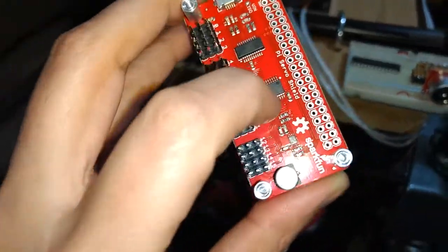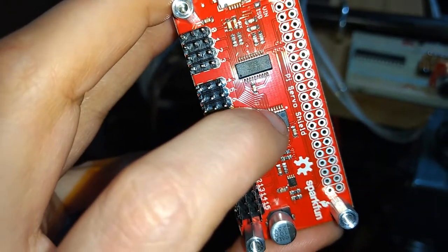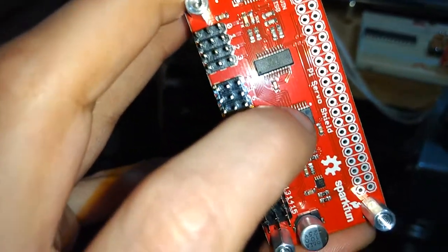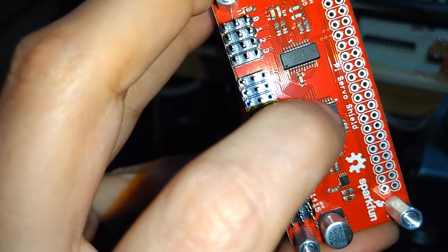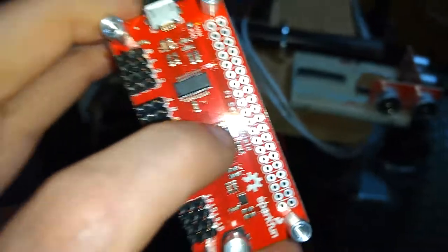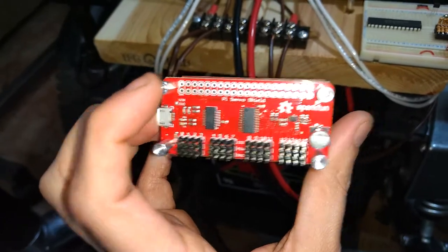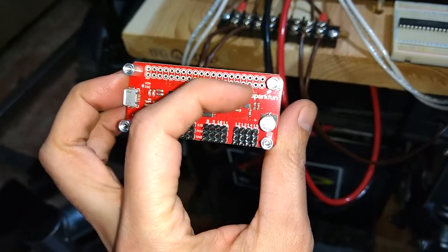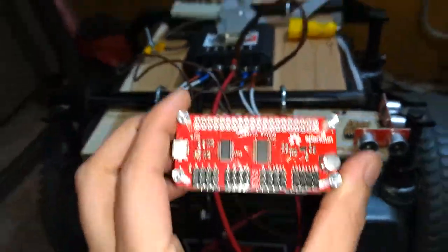I think it's this one here. The address lines that are right above my finger by pin 1 are floating. And that's how it shows in the schematic also. I'm going to try to solder some wire wrap wire on them and connect the ones I need to ground and the other ones to power, so I can use both of them on the same I2C bus, which doesn't use all these pins here. It only uses the I2C that's going to be up in this area here, so that way I don't have to have a huge cable going to the Raspberry Pi.